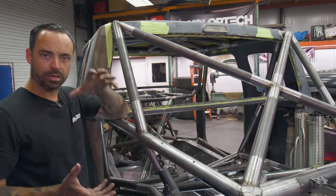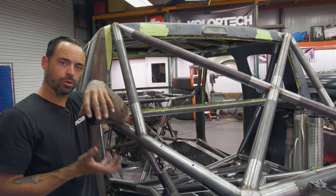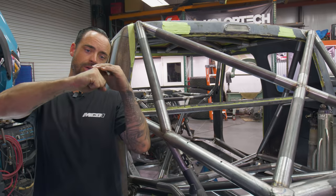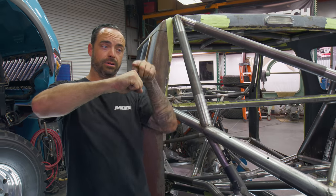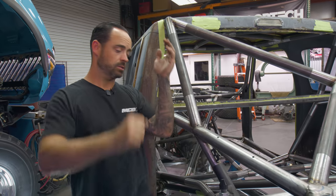Yeah, the one thing with putting a big pivot box on the end of your frame rail, or where your frame rail ends, is that if you have a cab where your pivot box is here and your cab's going further back towards the rear of the car, then you're going to have to float a C-pillar area or some structure back there if there's occupants or somewhere structure matters.